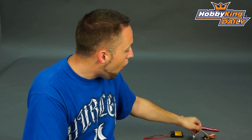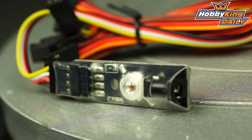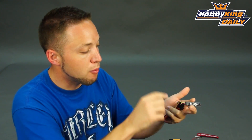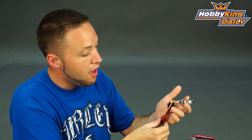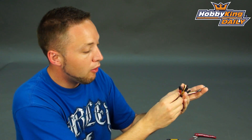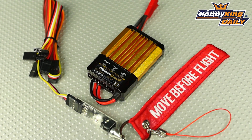Very nicely finished product here. Also comes with a cool accessory — this is like an LED strobe which will plug in. This will be triggered by the low voltage alarm on the regulator, so if you do get into low voltage with your receiver pack, this will light up a very bright white LED. It's an optional thing — there's a port on the device that you can plug that into if you choose to use it. And of course, comes with your servo leads as well, which are the interconnecting leads between your receiver and your voltage regulator. This comes with everything you need — you just need your own receiver pack to use with it.